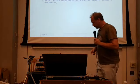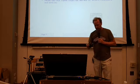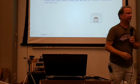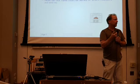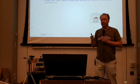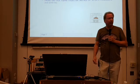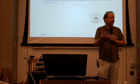Now, most meters are going to be kind of like the one that's going around, and like some of these other ones here. Here's another one to pass around that is intact. You probably won't break this one. I'll pass that one around too. Most of them do not have a built-in series resistor to set a voltage scale, or a built-in shunt resistor to set a certain ammeter scale. Some do, and you've got to really look at them carefully to see, but you almost have to test them sometimes to be sure. But regardless of what the scale says on it, it probably won't have those things in there.